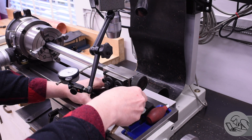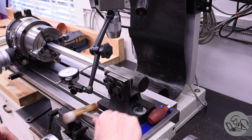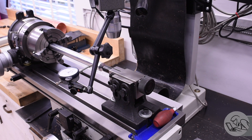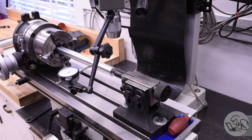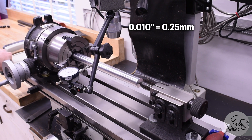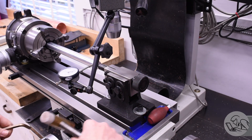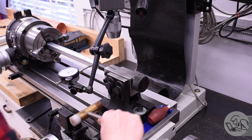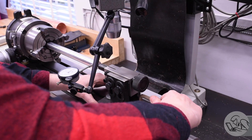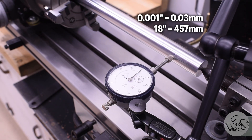For the Y-axis alignment, I've made the keys for my footstock a little bit narrower than the T-slots on the mill. The rotary table didn't originally have a key slot for the vertical orientation — I had to mill it myself, and it ended up about ten thousandths out. My solution was to make the keys smaller on the footstock to give myself some adjustment, so I can tap the whole system back into alignment. I'm able to get it within a thousandth over about 18 to 20 inches — excellent.